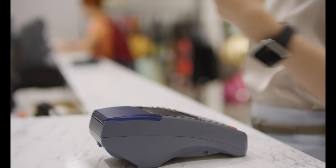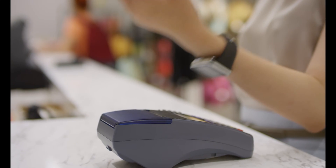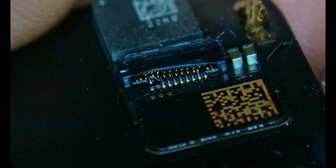The NFC is a critical component when it comes to things like Apple Pay. Many of you might know that if you replace the entire display on an Apple Watch you lose that function, and therefore you might have been transferring the NFC. In this particular case, this screen popped off and when it did so it damaged the connector on the NFC.